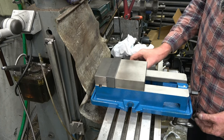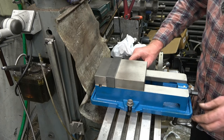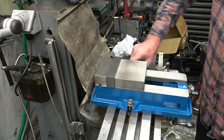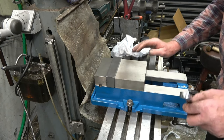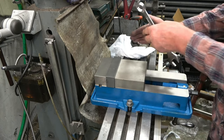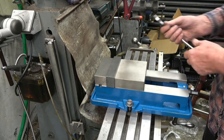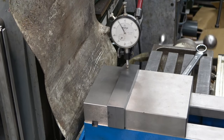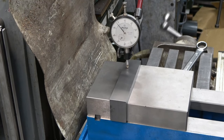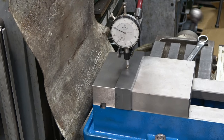So that's how I would use the vise — I wouldn't be using the rotating base unless I really need to. I'd just simply clock the vise in, and once it's on the machine you'd sort of leave it alone. It does pay to move it from end to end occasionally to save wearing the bed in one place, if you're fortunate enough to have a big enough milling machine. So now we'll put the clock on there — yeah, it is the same reading as before. So those jaws will need machining on the vise, and then it will be absolutely spot on.